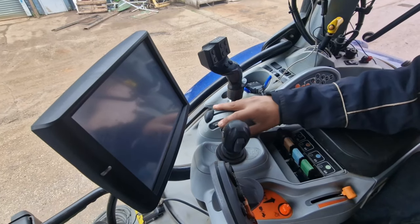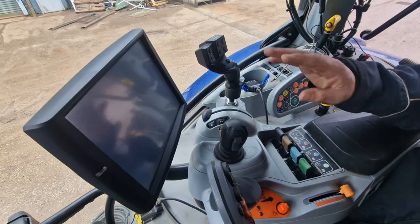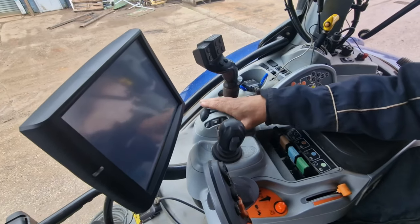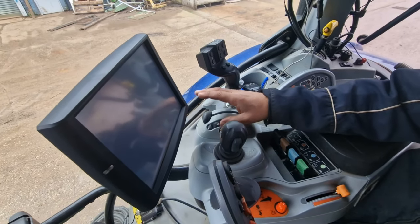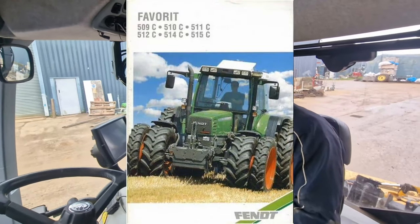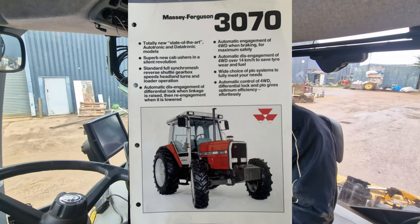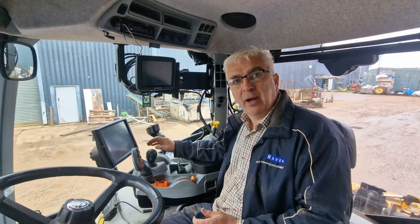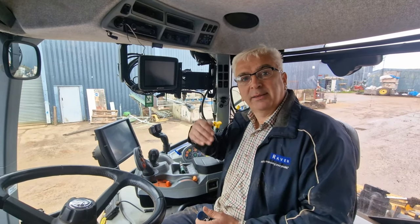This one is your draft wheel, which you can roll up and down as and when you're going through the field. These are now all electronic. I think some of the first tractors to have the Bosch electronic system were the Fendt and also the Massey Ferguson's when they went to the 3000 series - the 3070s, 3080s, 3090s - that type of tractor, about the late 80s, early 90s. That technology's still current and I'll show you why outside.